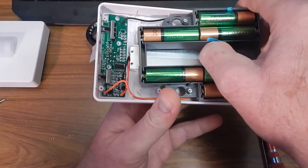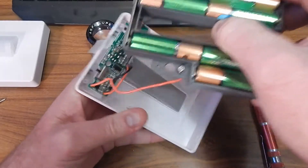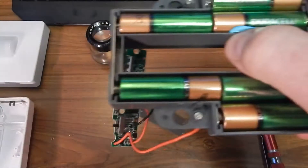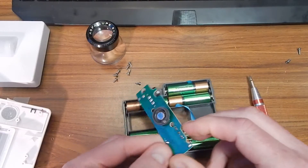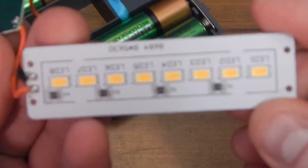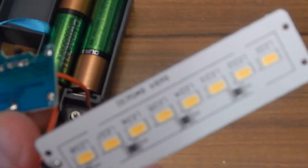Let's take out the battery holder and look at the LEDs. Everything in here has got good quality. I took all the screws apart so this just lifts out — normally it would have screws on the LEDs and screws on the PC board. So let's take a look at the LEDs. You can see these are warm white — when you get experience with these you can tell just by looking, they're more of a deeper yellow. Phosphorescent coating as we've discussed in the past — LEDs are blue underneath. The more phosphorescent, deeper yellow coating, the more warm white you're going to get out of it.